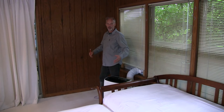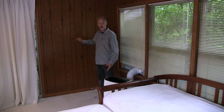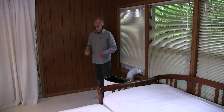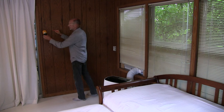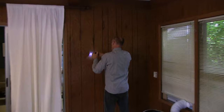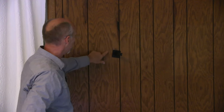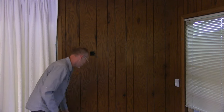The thought is there's going to be a queen bed here and the headboard will be here, so if people are sitting up they want to be able to sit without hitting their head on the two shelves. It went nine inches over from each side level, so we have a straight line where we're going to put the first shelf. There's a deep scan mode on here to pick up the stud — right about here. Not the stud here but we've got a stud on this row. That's just about where we want it.